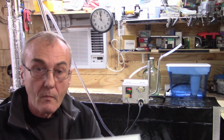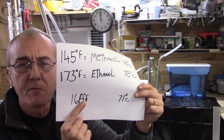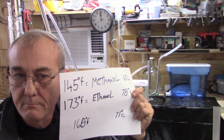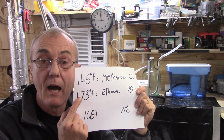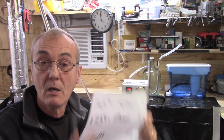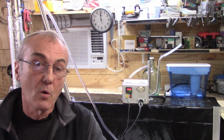Now, what do we do? We pick somewhere around 160 degrees Fahrenheit or 71 degrees Celsius. That's where I want to stop, and here's the reason why. I can't get to 173 without going through 145. Well, I know that 160 is not high enough to produce ethanol, but I know it's over the temperature needed to produce methanol. So in order to be safe, I'll move this and I'll set it for 160.